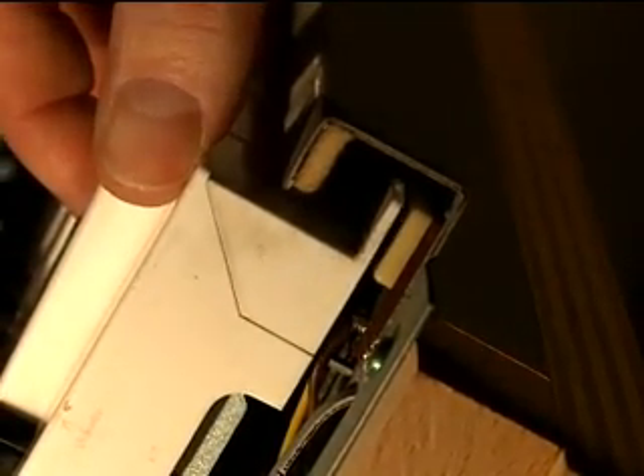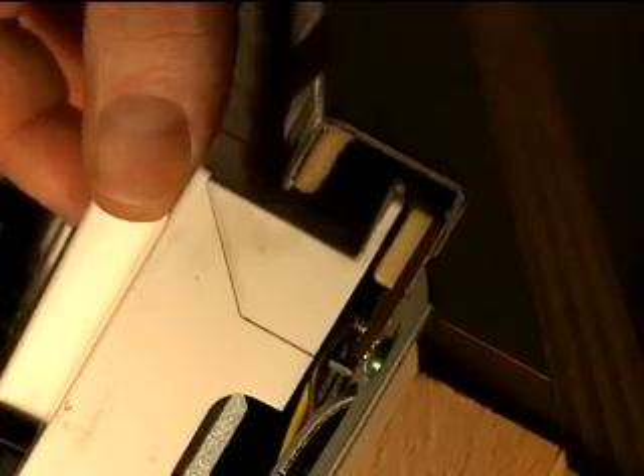The amazing part of the whole initial aftertouch system is that it is polyphonic — up to eight keys can be pressed, and all eight keys are analyzed in real time as to the pressure applied to each key. Although there are keyboards that do have aftertouch, it's just based upon one of the eight keys, whatever the system decides is the best one to measure, and they only use one sensor underneath the entire rack of keys.